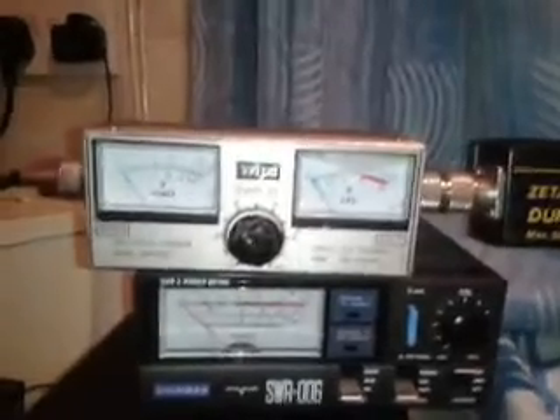The aim of the game is to adjust your antenna so the SWR is about the same on channel 1 and channel 40, and then anywhere in between will be about the same. That's it — it's pretty simple, really.